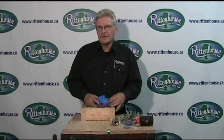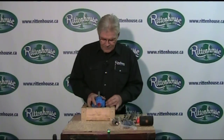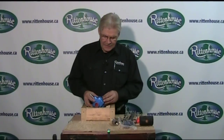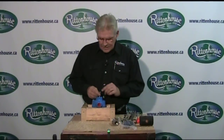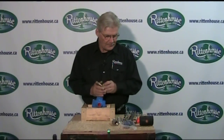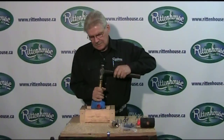I've built a little box to try to help me because I don't have a vise handy. If you have a vise, it's easier to work with and you can lock it in place. But without it, build a little box so you've got something to pound down so the case will actually split. Do not hit directly on the shaft — get a piece of brass and tap away.